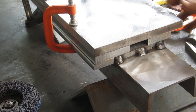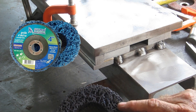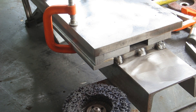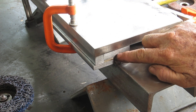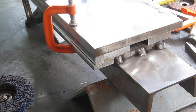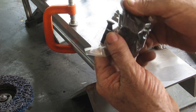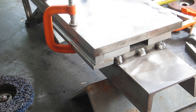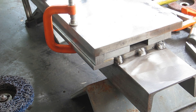I've spent a bit of time this morning cleaning everything up — getting all the paint, rust, and mill scale off. There's a link up top to a little video I made on removing mill scale — they are fantastic. What I'm going to do is dress a few things up with sandpaper, then tack this one, line it all up, tack it on both ends, and drill it in situ. We'll get screws through with countersunk cap heads so that this can run over the top of it.